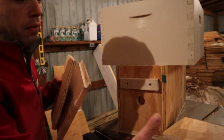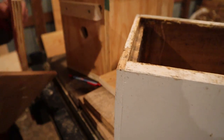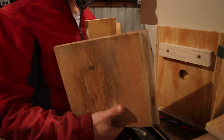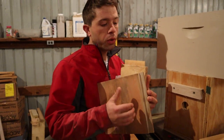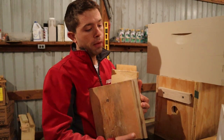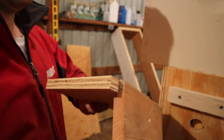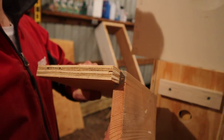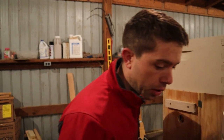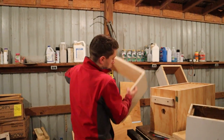However, you don't need that — you really don't. Over here we have a rabbet joint on this five-frame medium nuke. Basically what it is: you take a section of wood, use a stacked blade or dado set, and cut a big swath of wood out of there. Then you can just butt this up and nail it. That's basically the principle of how the rabbet joint works, and it works very well.